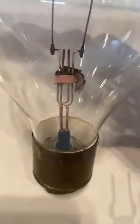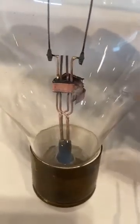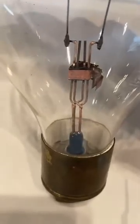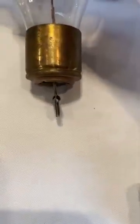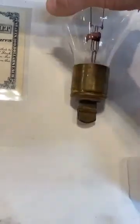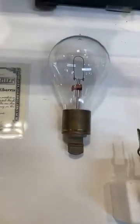There is also an apparatus inside that's coming apart here that was designed to short the lamp when the filament broke to maintain the series. The socket also was designed so that when you pulled these thin tabs out, the contacts would also short on the socket, so you could not break the series through either removing the bulb or the bulb failing.